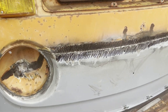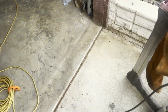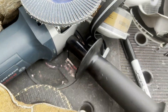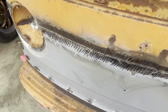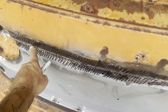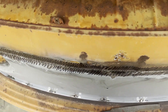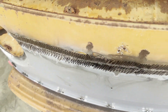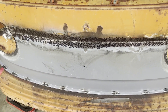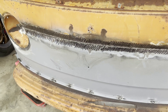I just used a Sharpie to paint a mustache on this thing, because I am going to be using that file to get the last bit and I'm going to try to avoid the grinder as much as possible. I've been using an 80-grit flap disc and a grinding wheel. What I want to be able to tell is when I'm getting close enough on the filing that the weld is basically the same level. There are some waves — this is a high spot, here's a low spot. It sunk in there; that was already there. If you remember, this thing was quite the potato chip to start, so my fix wasn't much of one. But in the end, it looks better than what it did, so I'll take it.